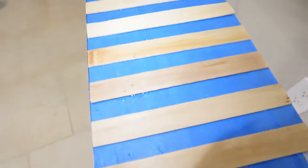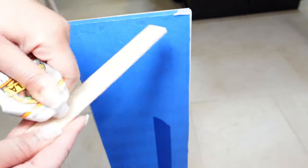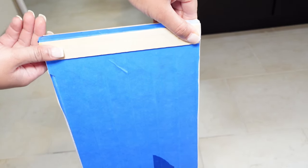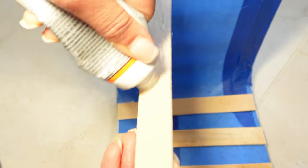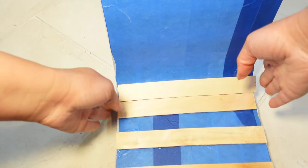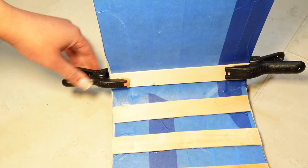So far, so good. On the curved parts, I added some clamps just to make sure it is secure and the wooden sticks wouldn't lift up. Now we're moving on to the inside, and I'm lining them up the same way as the outside — feeling where I lined it on the outside and placing the wooden sticks in the same spot on the inside. For the inside curve, I just found a spot that laid flat and placed my stick there. The clamps were essential.